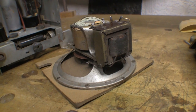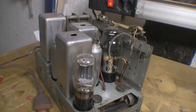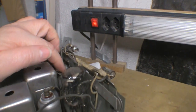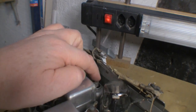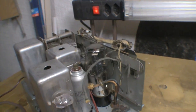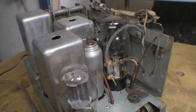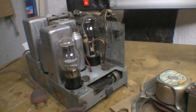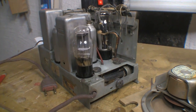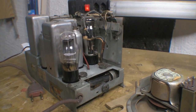I'm going to get all these valves out and test them. The odd one out is the 6E8 over here - the rest look pretty common, but the 6E8 seems to be a peculiarly European and French device. There's nothing in my valve tester about how to test it, so I'll just have to hope for the best on that one, although I have seen some documentation online.